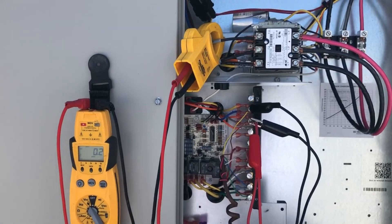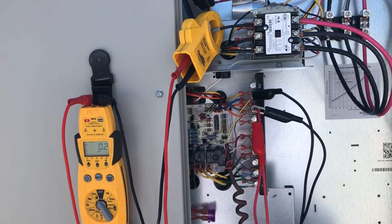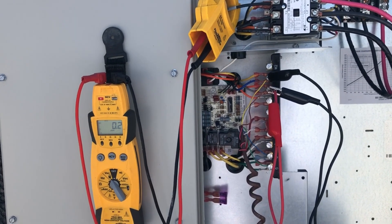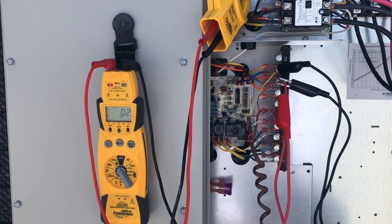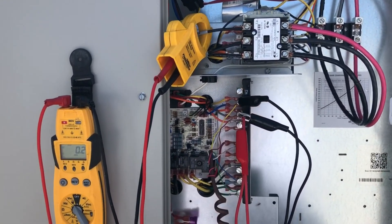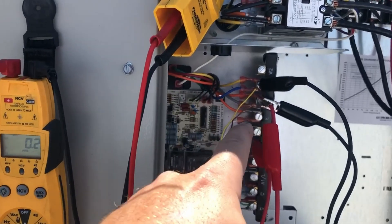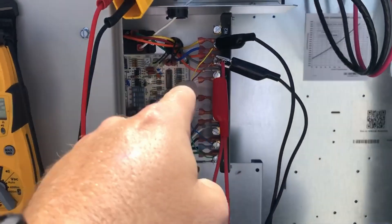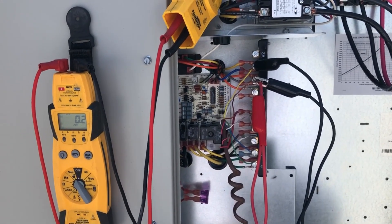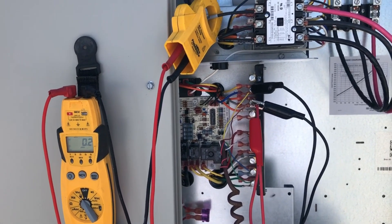The original call was weak airflow — about 300 feet per minute on a five-ton unit serving only about 1,200 square feet, so it shouldn't be blowing everyone's hats off. I checked the blower and found it was wired for low-stage cooling, which only changes the blower speed. There are jumpers built into it, so I moved the W2 tap to W1, which energizes the high speed on the blower instead of low speed. That should fix our airflow problem.